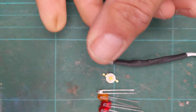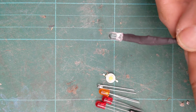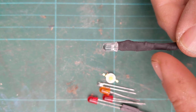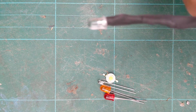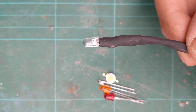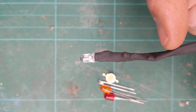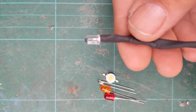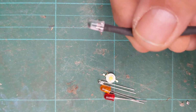Now, so why have we gone over to LEDs? Well, because something the size of this can give us a comparable amount of light, sometimes even more light than an incandescent bulb, and it's much more efficient. Okay, we're talking about over 90% efficiency, and the heat that does come off isn't from the light, it's from the power supply that gives it the power. Okay, because sometimes you have to reduce the voltage, or control the current going to it, and that little device will use some of the power.